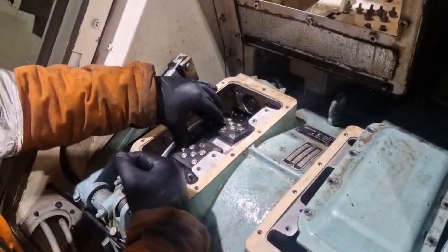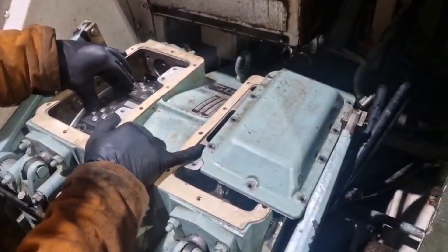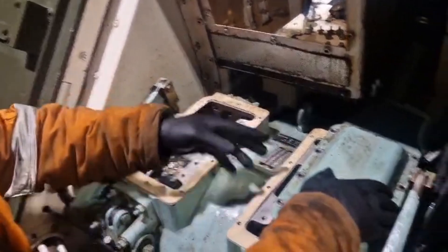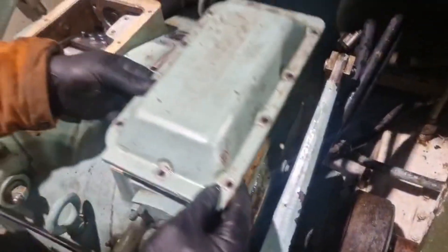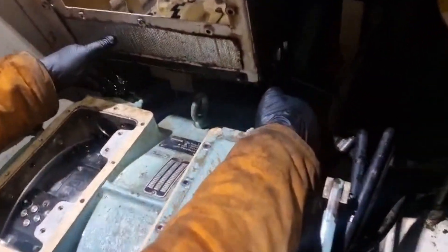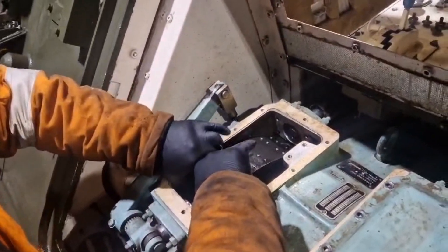This side is all disconnected now, so you literally pull the brake band out — it's the mirror and opposite of that one. That's then going to be cleaned and deglazed, then located back in the same way. We'll rebuild both up and then do a video of setting the adjustments to make sure the steering's okay. First, let's get number two out.